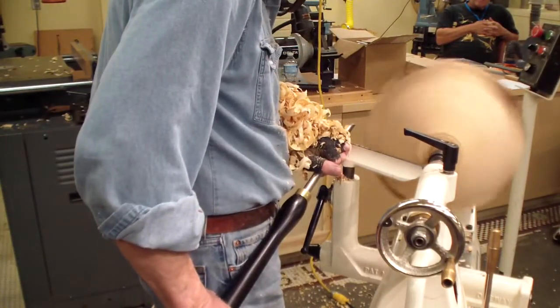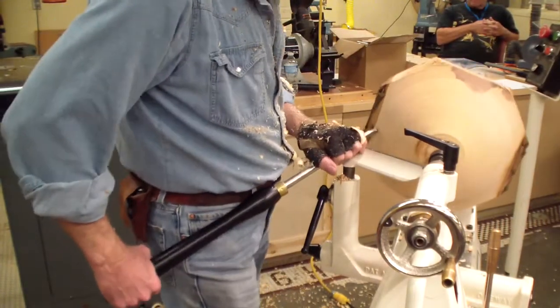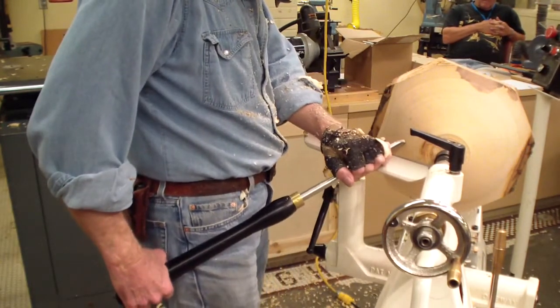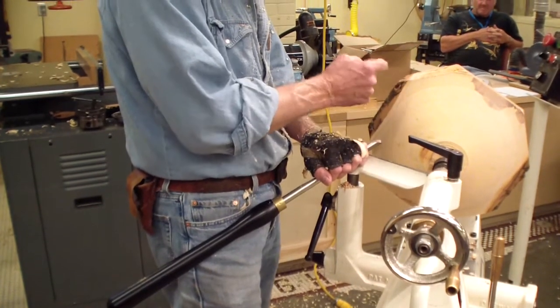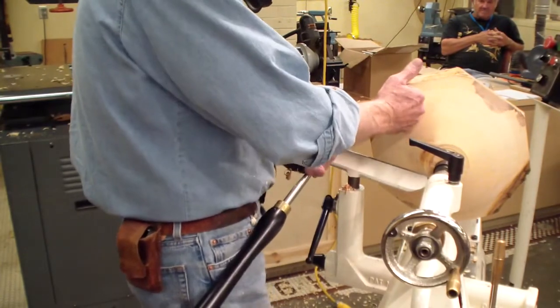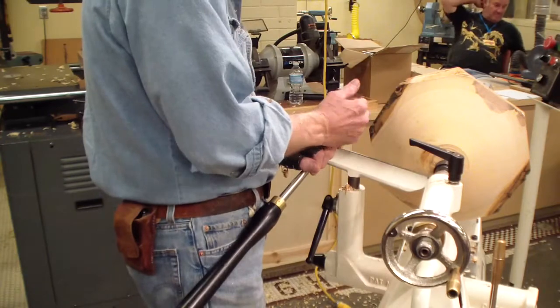And notice that last little bit, I rotate my body and I kind of peel out to the left. I've been coming up the fibers like this, right on tangent to them. I get to that last bit. I don't want to go into those 8 points. They're too aggressive. So I peel out like this, and then the tool actually comes very, very acute to those fibers, and it makes it much easier to cut.